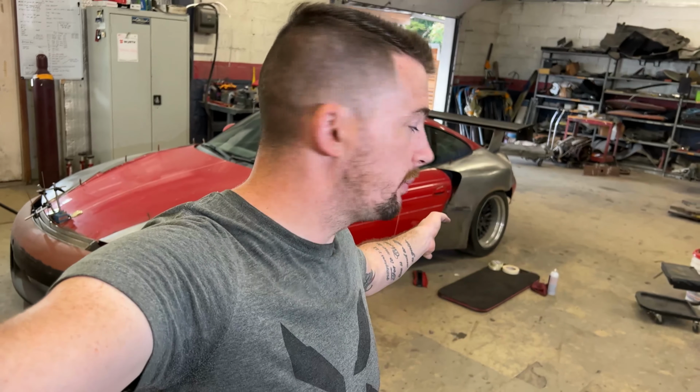So I think that about does it for this video. We started out with a pattern that we made from that rocker. We mirrored it, flipped it, cut it out of steel, shaped it, and put it on the other side, and it matches pretty good. So I'm gonna go ahead and go forward, and I'm gonna scribe it, cut it, weld it in, planish it, all that. And then my next video update will be whatever we're working on for that.